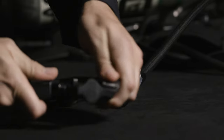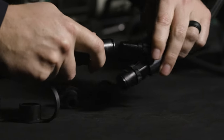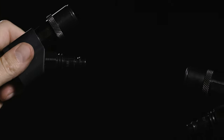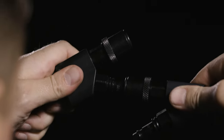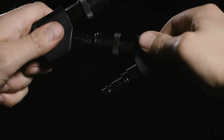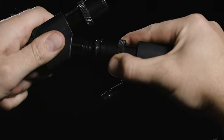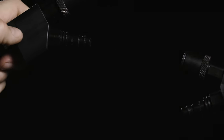Connection from the supplying SCBA can be either male to female or female to male. To connect, push the coupler firmly over the plug to engage. To disconnect, push the two sides of the quick connect towards each other, slide the coupler's outer sleeve away from the plug, and then pull the plug out of the coupler.